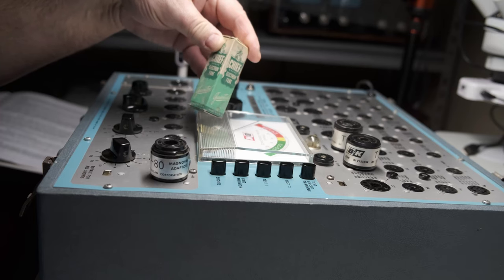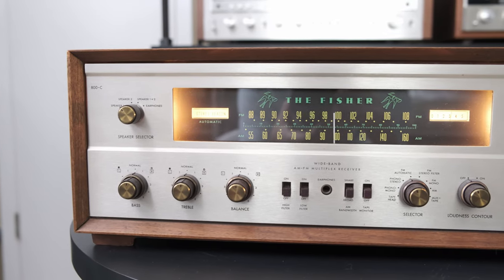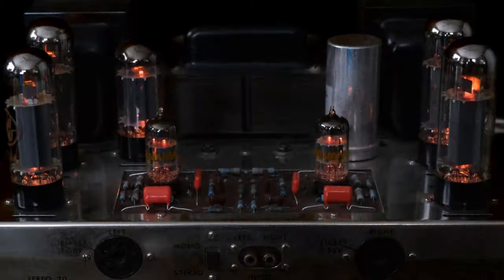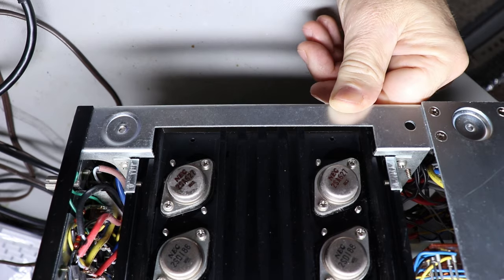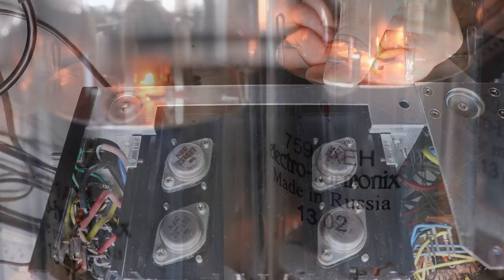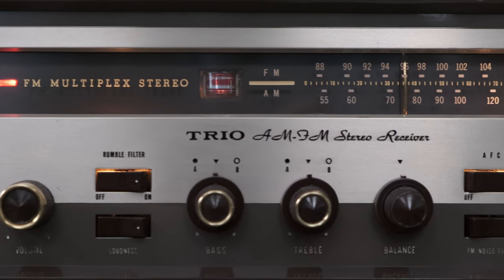That's a big reason to avoid vacuum tube equipment, but there are other reasons too. Vacuum tube-based equipment is just more expensive to maintain. It's not that tubes are inherently unreliable — they last quite a while. But it doesn't matter if your piece of vacuum tube equipment has been restored or not; the more you use them, the more you're going to have to replace them. With a restored piece of solid state equipment, you've got a real good chance it's going to sound just like it sounds for decades — you'll never have to get in there and do anything. But tubes aren't like that. You don't even realize how much the sound has degraded until you put a new set of tubes in. To really keep your tube equipment running at 100%, you've got to spend money on those vacuum tubes.